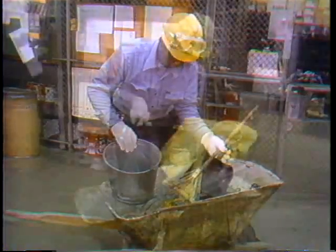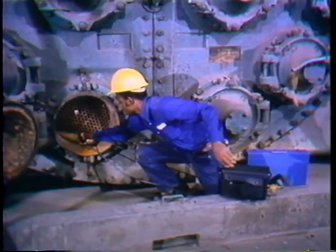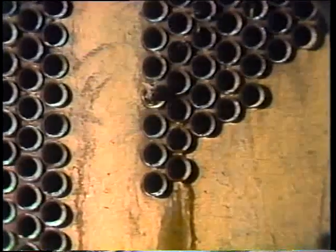There are basically just two things that can go wrong with heat exchangers: blockage and leakage. When our mechanic got the work order to open and inspect the main condenser on number 12, he knew pretty much what he was going to find and planned the job accordingly — choosing the necessary cleaning tools as well as his personal protective gear. Once the unit was opened up and the air quality check confirmed the air was safe, a quick inspection confirmed his judgment about what had accumulated inside.